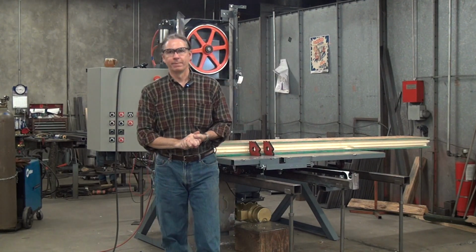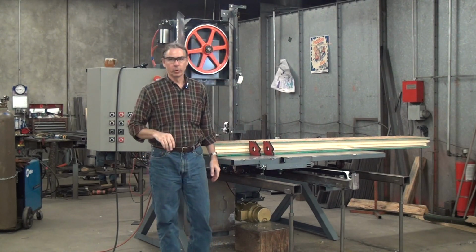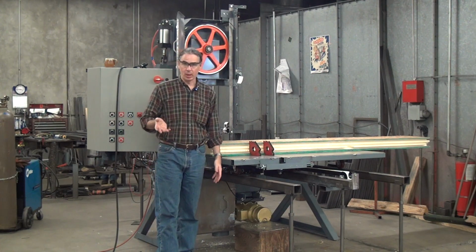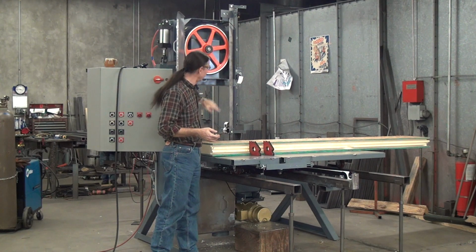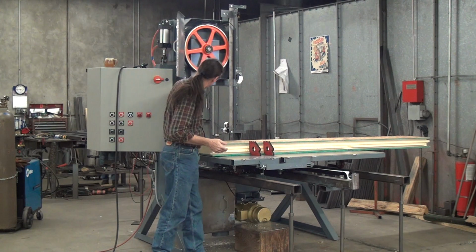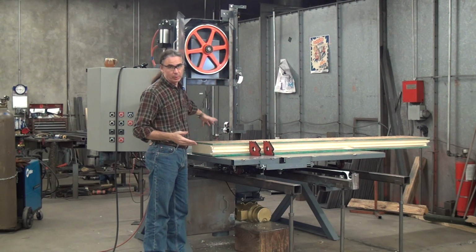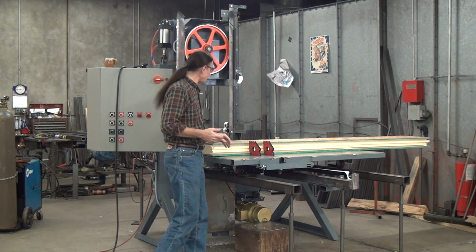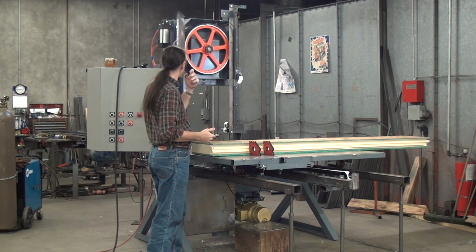This is an introduction to the Forrest Manufacturing Model 204 Heavy Vertical Blade Traveling Table Bandsaw. The 204 family of saws are all built with two 20-inch diameter blade wheels. To a large extent, this defines the geometry in that we have a maximum 20 inches of horizontal throat available. Really, we advertise 19 inches with our 20-inch wheels here. We can make these taller, but that horizontal throat is fixed by the size of the wheels.